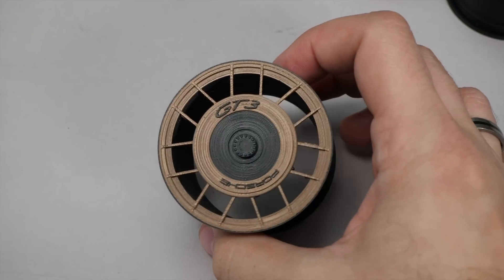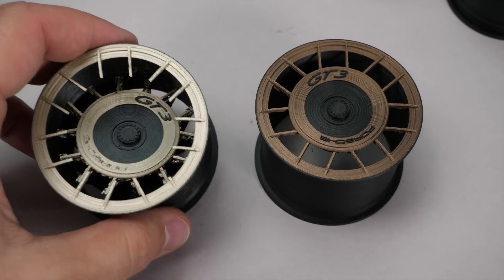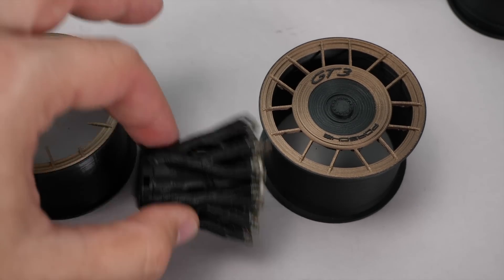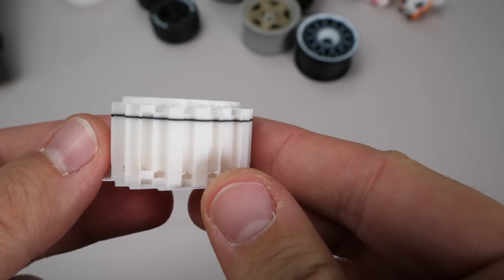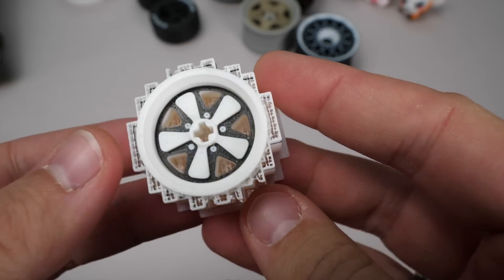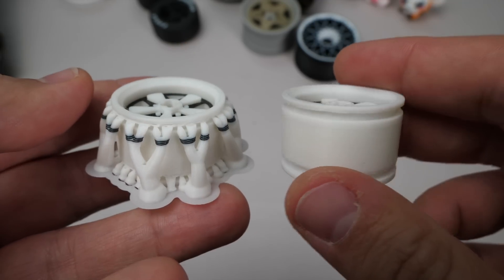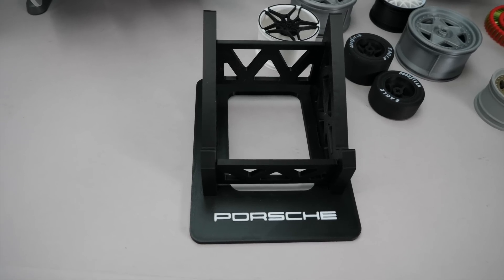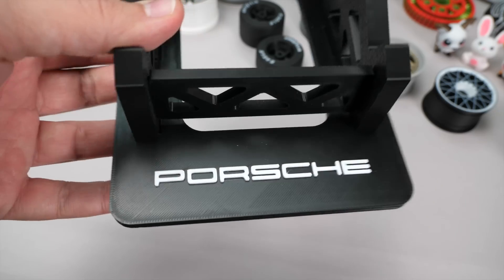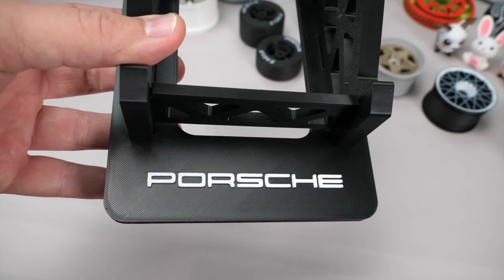This Porsche rim is quite cool, and this is what happens when you want to remove all the spokes — it helps to cut the individual branches first rather than remove the tree support in one go, works much better. These smaller Porsche rims show that sometimes the support added by the designer doesn't work with your filaments perfectly, because I couldn't remove it well. I replaced it with the tree support, and that looks much better. This is a simple stand for the LEGO Porsche set — it only has one multicolored part, so it was pretty quick to print and without a lot of waste.